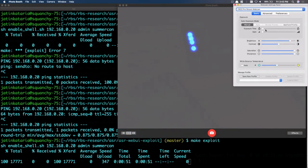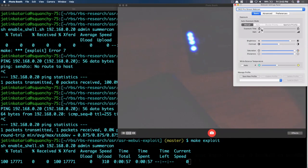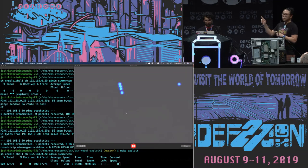So that being said, think about all of the devices that are affected. This thing has been in deployment since 2013. This vulnerability is in all of those devices. So if anyone finds any kind of code execution on any part of that attack surface, there's a chance that this has not only affected your router, but is persistent to the point where, in order for you to get rid of it, you probably will literally have to desolder a chip from your router or your switch, even just to test whether you've been exploited or not.